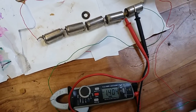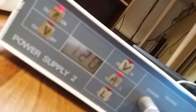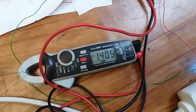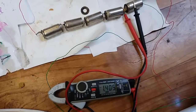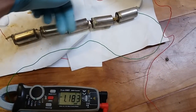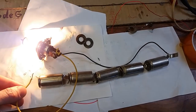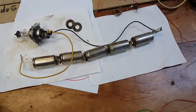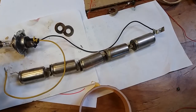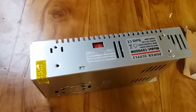Let's give them a quick charge using my bench power supply. It's charging at 1.2 amps, which is 1C for these batteries — a quick charge — and the cells are 1.4 volts each with roughly the same voltage across all of them. Nothing is hot, everything is cool, and it's charged and works nicely. I'll choose the best four pieces, give them some Kapton tape as isolation, and make a small 4.8 volt battery pack for my small power drill.